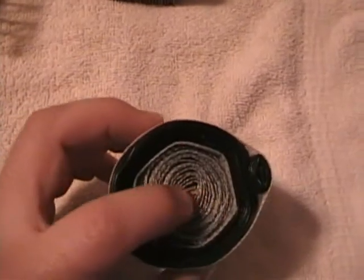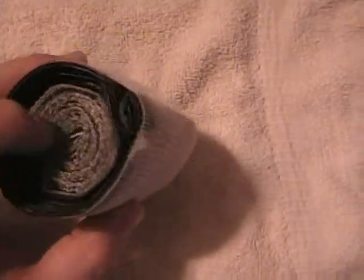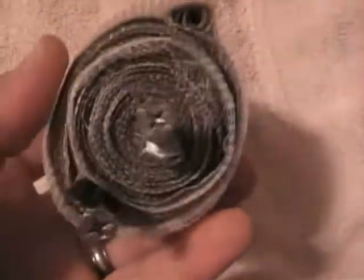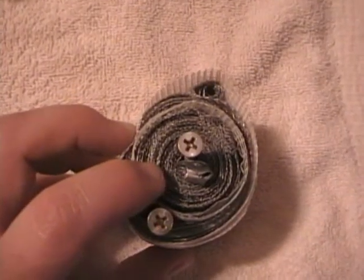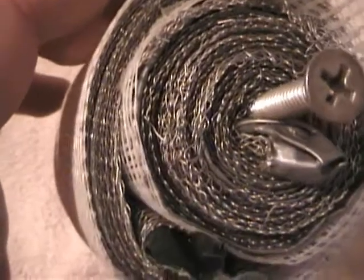Then I had an idea and I went and bought some aluminum screen — this is your basic screen that you would buy to replace a window screen or screen door. All the other cells here are stainless steel, whereas this is aluminum. What I did is I cut these strips, and I also bought some nylon screen — you can't quite see it in there — which doesn't conduct any electricity, and I just rolled the nylon in between the two aluminum strips. So you've got a pretty tight roll with positive, negative, positive, negative alternating all the way out.